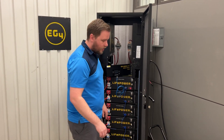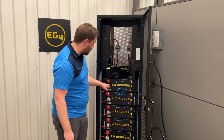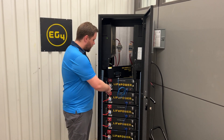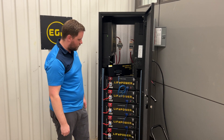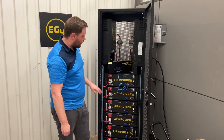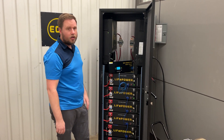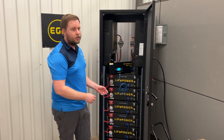I'm going to turn this off. Again, if this happens to you, it's very simple to restart. You simply turn the battery off, wait a second, make sure your inverters are in the off position, and then you can turn your battery back on. I'll turn two of them on here. Now I've got both inverters — I should be able to turn those on without any issues. As you can see, they're ready to go again. So if you ever do encounter this, it's very simple to reset: just turn the batteries off and restart.